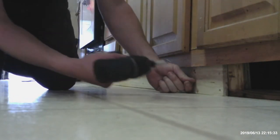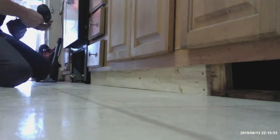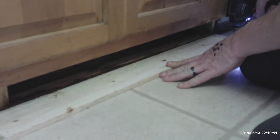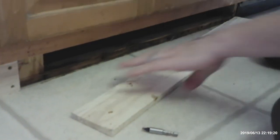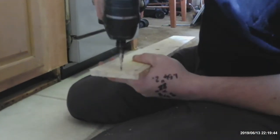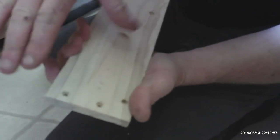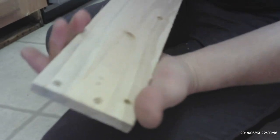This is literally just a stopgap to stop our pesky rat situation. This is the bit for the screws and this is my countersink bit. I'm going to mark roughly where I want the screws. It puts a little countersink in the wood for your screw head so you don't have to squish the wood down to get your screw in. Plus it means the hole is big enough for the thread, and if you're drilling on top of something else the drill bit is small enough to be a pilot for a screw and it will still grip the wood. So you can actually put this on something, go all the way through, and it screws in and clamps up really nicely. It's very useful.